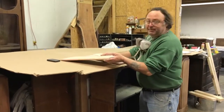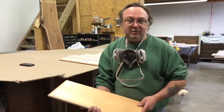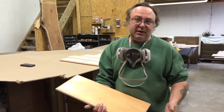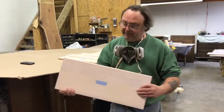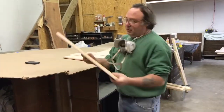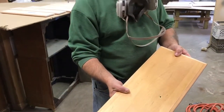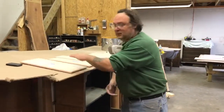Getting back to the maple cabinets — this is the back side here, you can see it's already been shaded. Cory and I had stripped these cabinet doors and drawer fronts down to raw wood, sanded them, and then put two coats of a pre-catalyzed top coat on. You can use sealer, but when you're spraying with pre-cat you really don't need to. If you use nitrocellulose lacquer you want to go with a sealer coat under it. We sanded it and then this side has already been shaded to color with the pre-cat lacquer and top coating. Now we're going to show how we take a board like that and flip it into the whitewash with our lacquer.